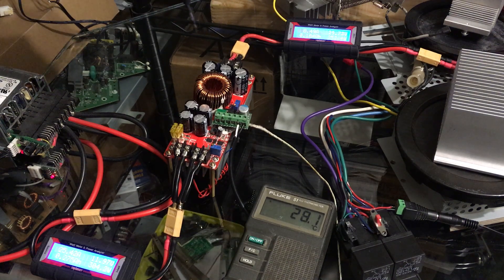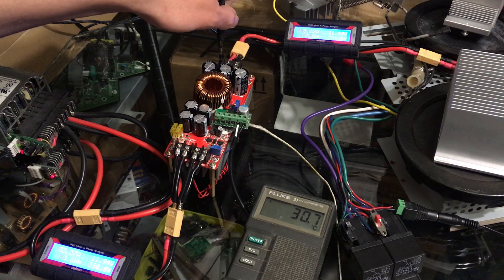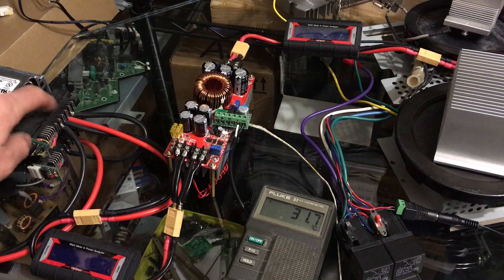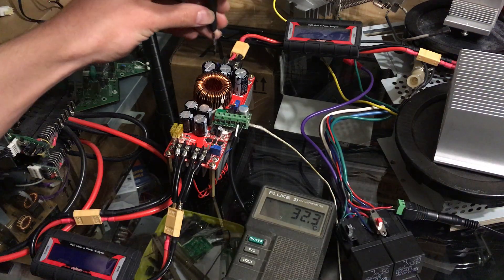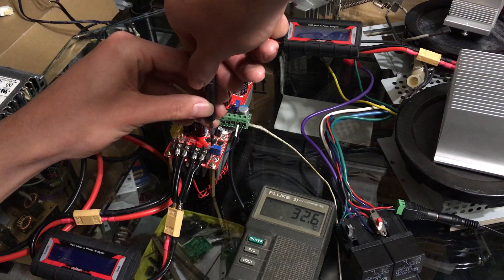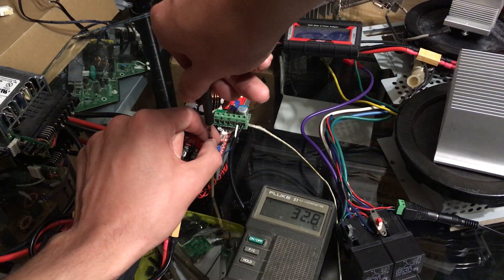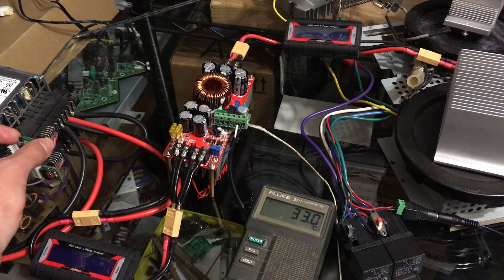Still 15 milliamps on the MOSFET driver — and it powered off. The power supply went into overcurrent protection. I'm going to flick these off and maybe bring the voltage down. I'll bring the under voltage lockout back down. Zero amps on the MOSFET drivers. I don't know why it tripped because that was only 35 amps I believe.